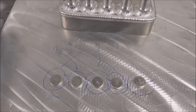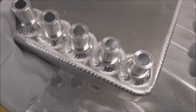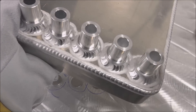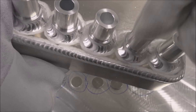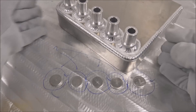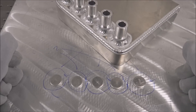If you do it that way, they're not all going to look the same. The way I did it, I did this one, this one, this one, this one, this one — you run around that one and then around this one, keep going. The only hard spots you have are the weld start and the weld stop. These halfway points are really easy to do. So for the sake of making them all look the same and maintaining symmetry, I did it the way I did.